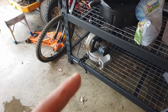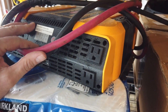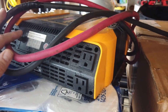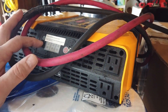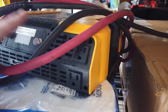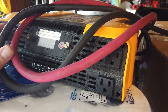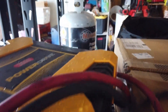That's fine — 20 amps give or take for a split second wouldn't pop a breaker, which is what we'd expect to see. So this little inverter works, which is awesome. It's super interesting that it would not run the inverter welder. I'm probably going to hop on Google after this to look it up, because I'd like to maybe run an AC stick welder. I don't know if there's something weird going on with DC to AC to DC conversion — I'm not smart about that stuff.